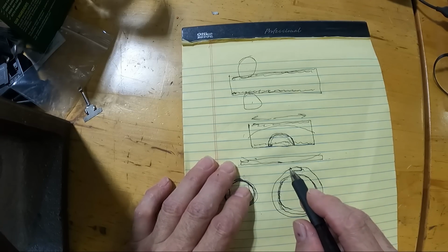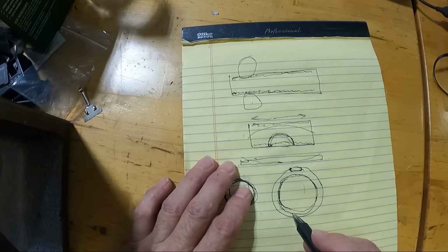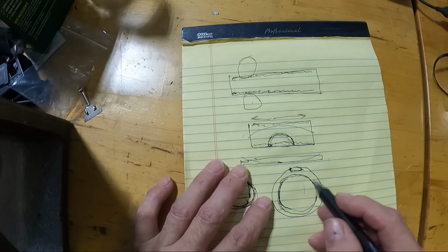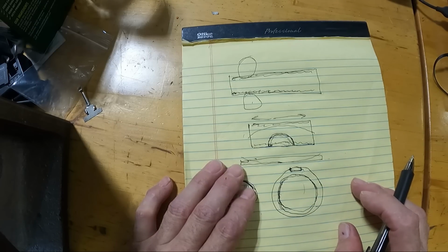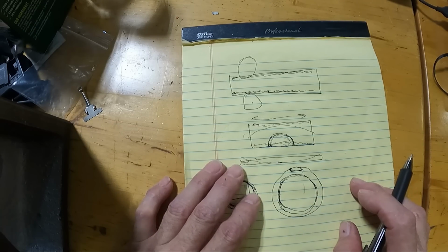And I told him, I said, man, when I cut the keyway, I think it had a keyway there, and then it had a couple of smaller keyways. I can't remember exactly, but I told him, man, when I cut those keyways the full length of the part, this thing's going to egg and go out of round. And sure enough, it did.